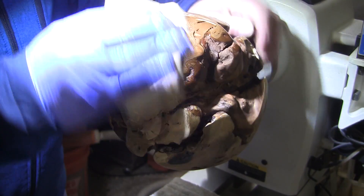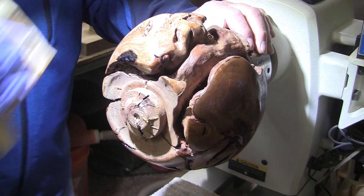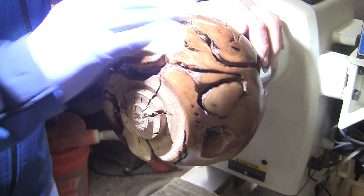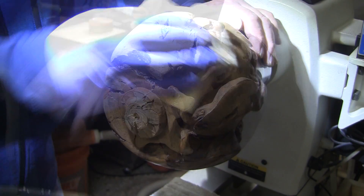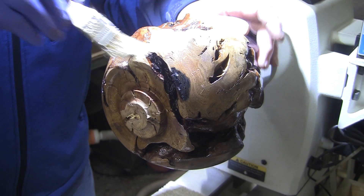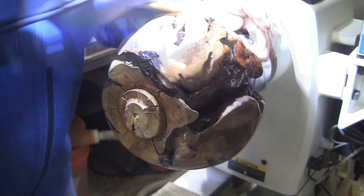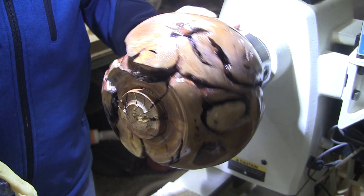But it's done now, and it feels like a bowling ball — just smooth, just real smooth. So I'm just putting a coat on the outside here — and I call the outside the turned part, not the unturned part. I will get to the unturned part in just a minute, but I want to get this on the outside first to seal it up so that when I'm brushing it doesn't leave a line on the finish part. My goal here is just to cover everything — get the sanding sealer everywhere I possibly can. So I'll put on at least two coats of sanding sealer. Now I need to take a rag and wipe off the outside, just so there's no built-up edges. I'll come out in the morning and sand first, then put a second coat on and see if we need a third. Have a good evening.